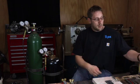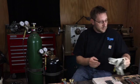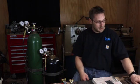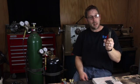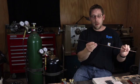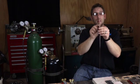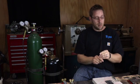Next we're going to talk about PPE. You want to make sure you've got a good set of welding gloves to protect your hands, a pair of pliers so you can grab any hot parts, a striker — do not use a Bic lighter. Another important one is your welding rod. This is an RG45 rod, which is a standard welding rod for oxygen and acetylene welding. One of the things I like to do is bend the tip over to try and prevent from poking an eyeball out.